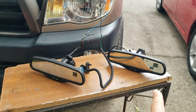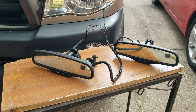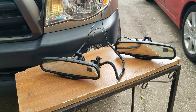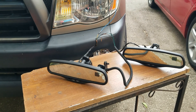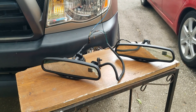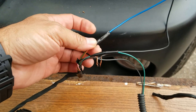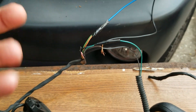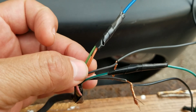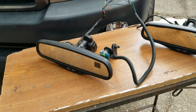After playing with the original mirror quite a bit, sometimes it would work and sometimes it wouldn't, and the display was not as bright as it should be. I ended up going back to the salvage yard and found another mirror from another GM truck. I tested this one right at the salvage yard and it looks brighter and works better. I have the wiring already done — I taped up the positives, the black one is ground, and I have the green one connected to the pink one, so otherwise it dims completely.